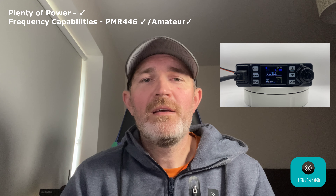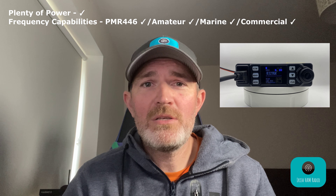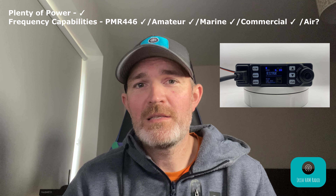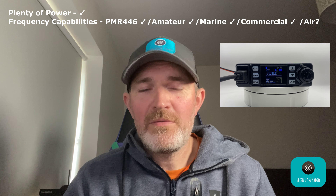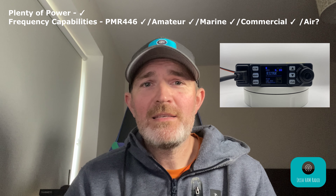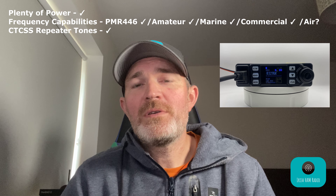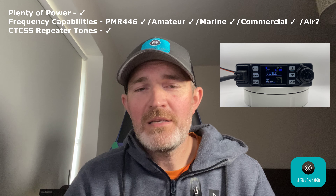On the VHF side of things it's brilliant. Not only have I been able to configure the amateur band side of things but I've also been able to configure all of the marine channels and some commercial band frequencies as well — these are well outside the 144 to 146 megahertz quoted in the specs. I've purchased two of these radios over a year apart from two different suppliers and both of them had the same frequency capabilities, so it's not a fluke. It of course supports CTCSS tones, so you'll have no problem opening any repeaters gated by CTCSS.